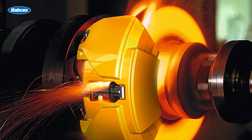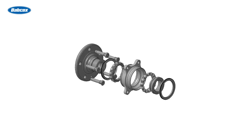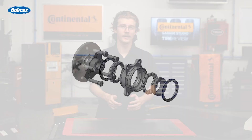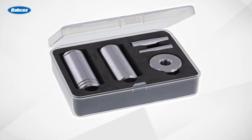Also, don't forget to check for signs of heat damage. Then, make sure you have the correct seal and check the fit on the shaft and in the housing. Before installing the seal, lubricate the lip. If you skip this step and the seal is installed dry, the lip will overheat as soon as the shaft starts turning. Lastly, use a seal installer to tap the new seal into place.